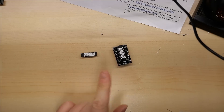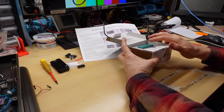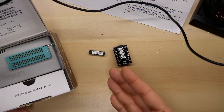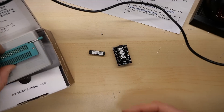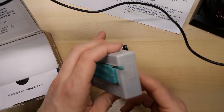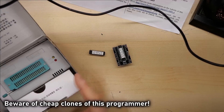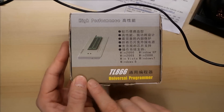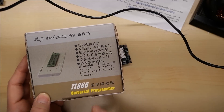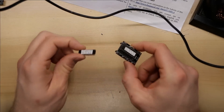Daniel included two programmed 16V8s. But if you are making one of these yourself, just like on the Commodore 64, you use something like the TL866 programmer, which has no problem at all programming these chips. These chips are easy to get from places like eBay and AliExpress — they are not made anymore, so they'll be old chips pulled off boards or new old stock. But these programmers are still made. They work on Windows, Mac OS, and there's now open source software for Linux, so you can absolutely plug this into your computer via USB and very easily program these chips. I do highly recommend one of these programmers — I've had this one for quite a long time. There's a Model 2 now with a bit more support for some chip types, but it loses support of certain old EEPROMs, so I keep this first generation around.